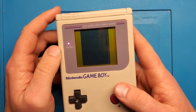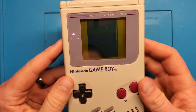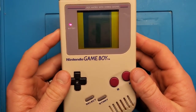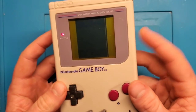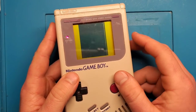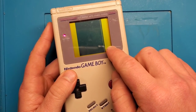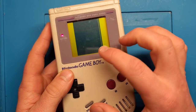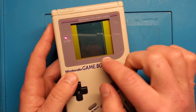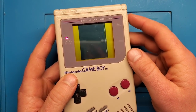Okay, so we've got power and right away we can see we've got a bad display. Let's check the contrast wheel. You see these big lines down the middle — when I have the contrast cranked all the way up this whole screen should be dark, but you're seeing these light bars on the side and one vertical line. Not uncommon at all. There's a little ribbon connector at the bottom that feeds into this board and we're going to have to reflow that to get this working.